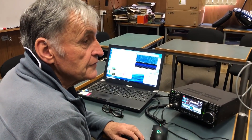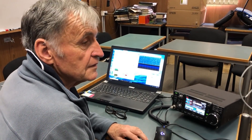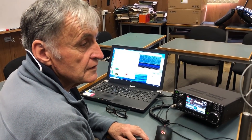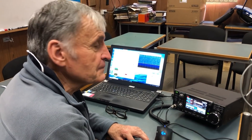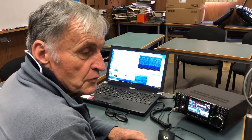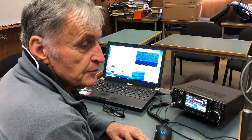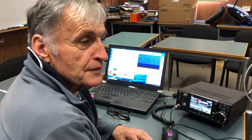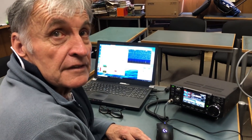Because the fan has been off, we would expect that as soon as we start transmitting the fan will come on and it will drift rapidly the first time and it will not decode. We're not GPS locked either — this is just the radio. The radio is incapable of GPS locking, that's the problem. So it is a test of the performance of the internal oscillator in the radio.